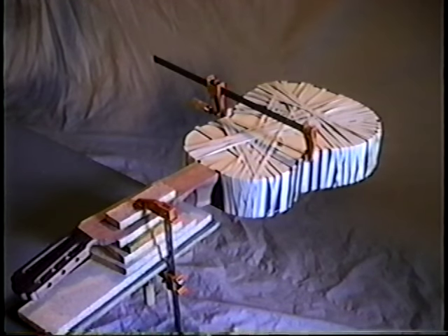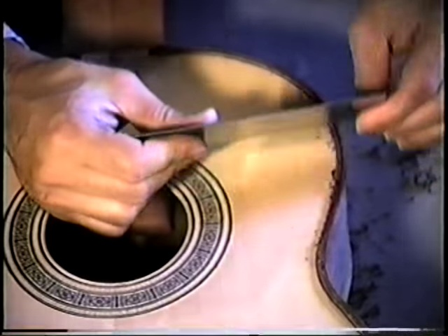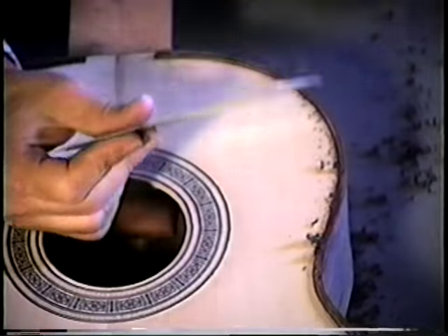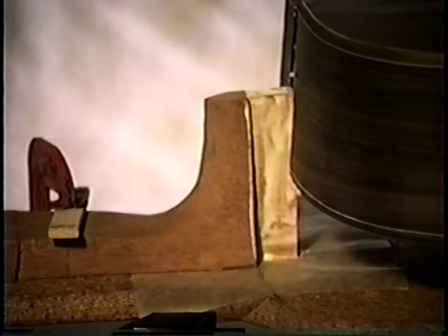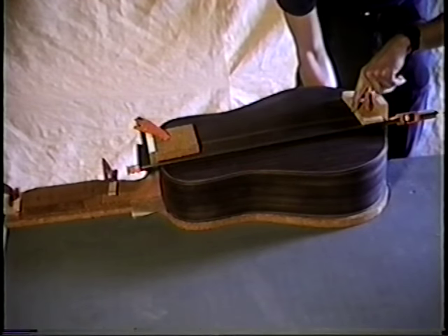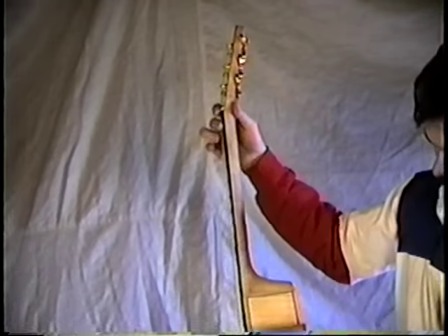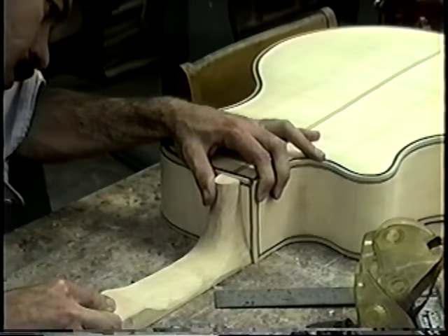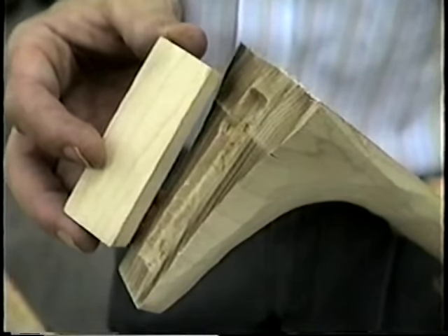A furniture clamp provided extra pressure on the waist of the classical guitar. After removing the rubber bands, the purfling is scraped and sanded flush with the body. The bindings tend to split very easily when scraping or planing. To attach the neck to the steel string guitar, we secured the neck to the workboard and made sure everything lined up. Once everything checked out, we glued and clamped the assembly together. We also followed the construction of a blonde cutaway guitar featuring a neck-to-body joint where a splice joint was created by routing out the neck and the body — a simple and effective way to make the joint.